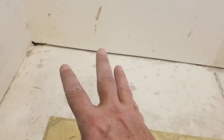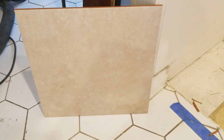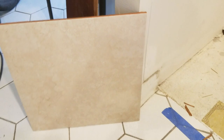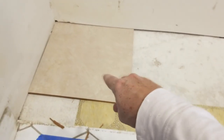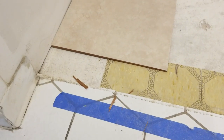What I like to do is what we're going to show you here today is we're going to lay down just a few pieces of cheap tile along the back here. We went to Home Depot and grabbed some really cheap 69 cent per square foot ceramic tile, cheapest we could find, was on the closeout bin. The idea is we'll do a row of these tiles going across the back there, and make the top surface of these tiles match the top surface of the existing tile.